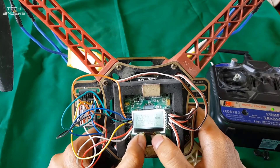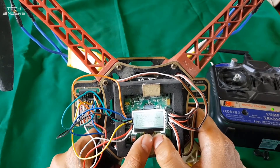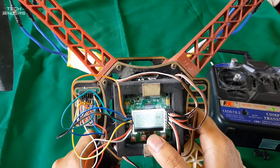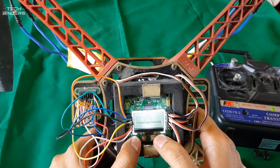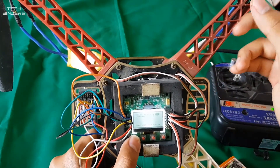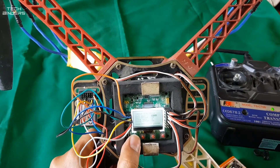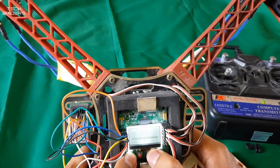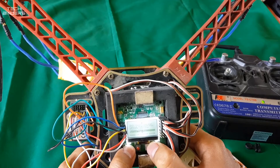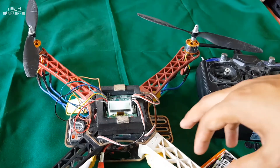Board offset — I don't know exactly what it is. Spin on arm allows it to spin on arm for maneuvers but it's not very stable, so I don't recommend it. Gimbal control is not of any use because this board is not built for taking a gimbal. Moving on to servos on arm — you are not having any servos, you have brushless DC motors, so it is not required. Self stabilization settings include roll gain and pitch gain — these are the PI tunings and should be at default for now.